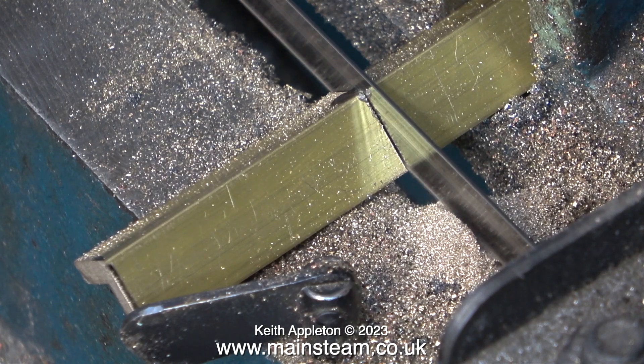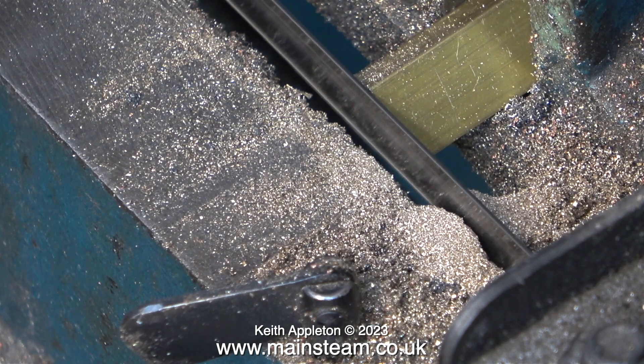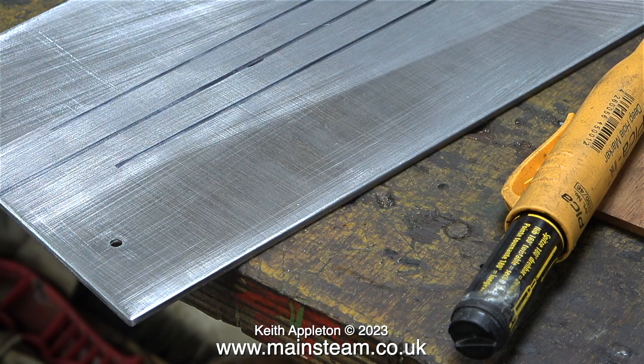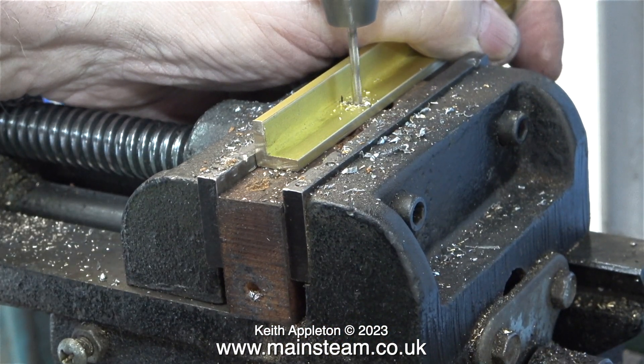The next part of the job requires me to cut these pieces of brass angle to the correct length. I've already cut one, and this is the second piece. Now I'm marking out the pieces of brass angle to drill holes to mount the two pieces of angle that will support the burner to the steel plate. I've come up with an idea that I think will work well: I'm going to elevate the brass angle away from the steel plate so the heat from the burner is not directly conducted to the plate. I'll hold it on four bolts.